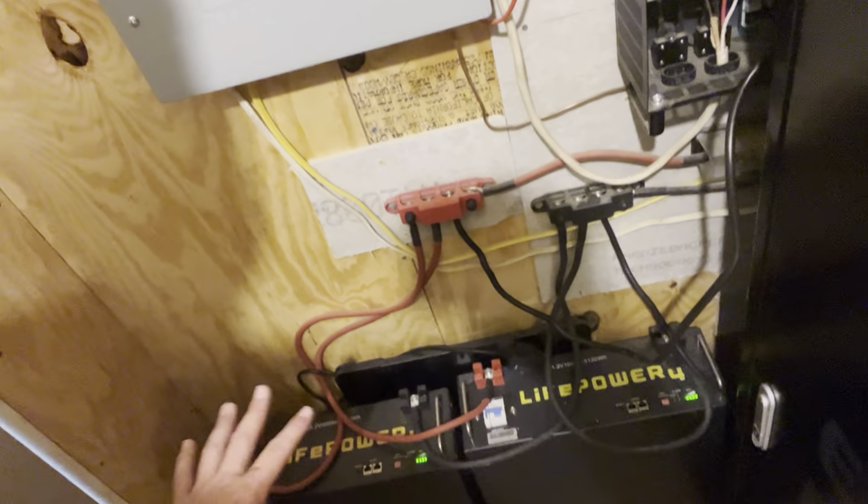And then secondly, even though these are about as safe as you're going to be able to find for battery systems, there's never no risk. If something happens and they do go off, they shouldn't, and they shouldn't go off explosively like most of the other lithium ion chemistry out there. But if something does happen, they can burn, and you're going to have to contend with that. Do you really want that in your living space, especially if you have a loft like we do, so you have people upstairs and you have to think about egress and getting out on a porch roof and jumping off and that sort of thing? Not worth the risk of burning my cabin down is a decision I came to.